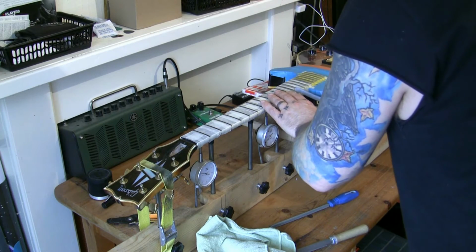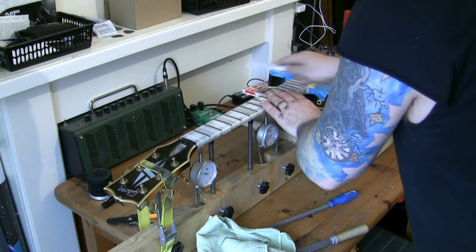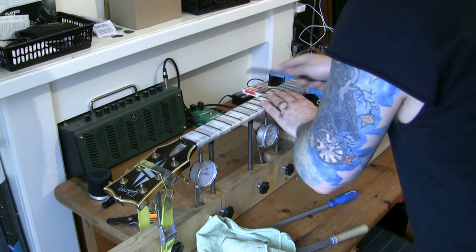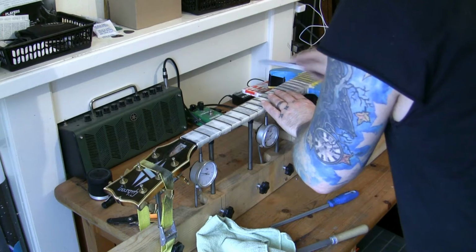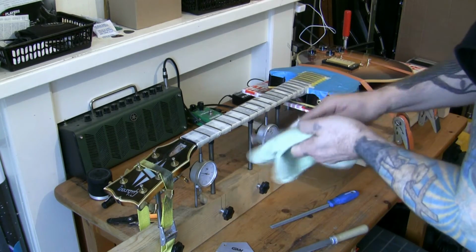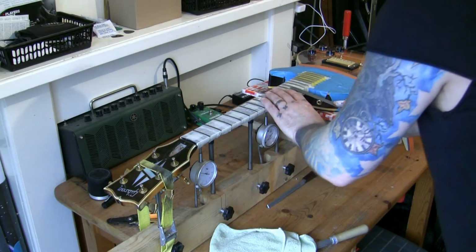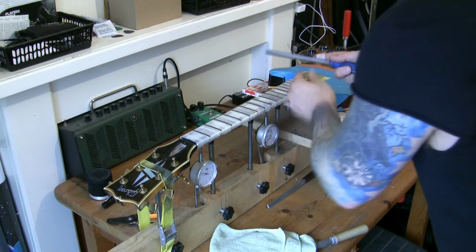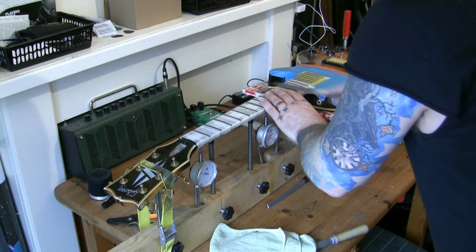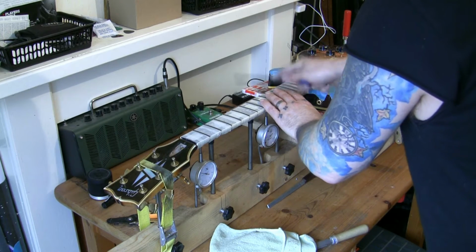And we're looking for that thin line on top there. See, we're rolling away from you now, just to get that curve in there. This is a double cut, cuts both ways, this file. It's a really smooth file as well, it's like a number 3 cut. Don't need to go mental.